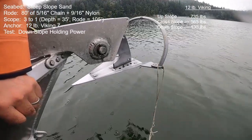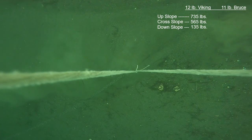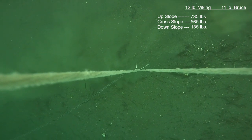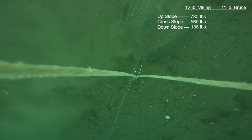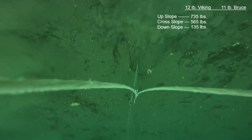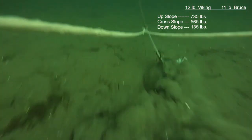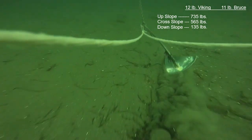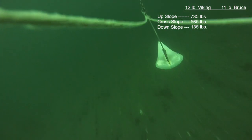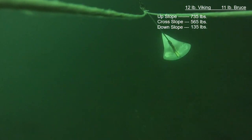Here's an example of that near-disaster from pulling too far on these downslope pulls. This is a 21-pound Spade S60 using that same rode of 80 feet of 5/16ths chain. The rode and anchor combination is well over 100 pounds, and once it takes off it doesn't stop — it just slides down the hill. Chain catenary is mostly pulling this. The boat motion stopped and there was nothing I could do from the surface; the anchor just took off sliding down the hill into the abyss until it was vertical. It took quite a bit of time and struggle to retrieve it by hand with no winch on board, nudging the boat into shallower water incrementally.